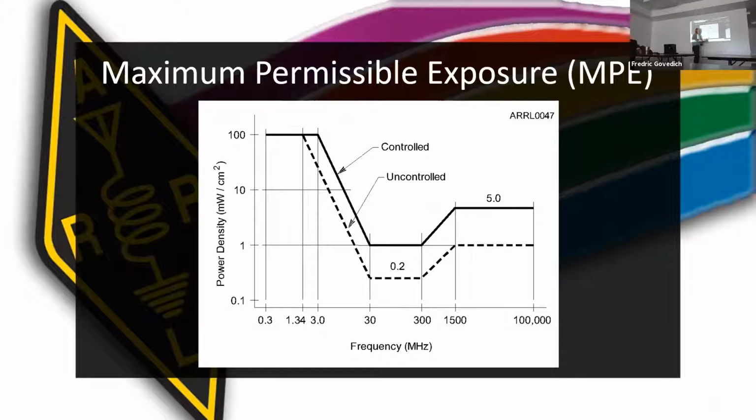So the big primary thing is 6 meters. The question is going to be on 6 meters, 54 megahertz. The reason is that the quarter wavelength for a 6 meter antenna is about 6 feet. Well, we happen to be about 6 feet long, so we're right at the physical size of a quarter wave antenna for 6 meters. So they're going to want you to keep the power levels low on 6 meters. That's the only really dangerous frequency range. Nobody else hardly uses 6 meters anyway, and I don't have any 6 meter repeaters around here.